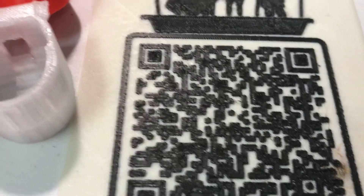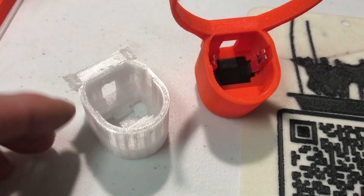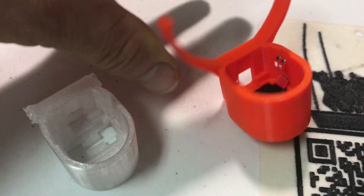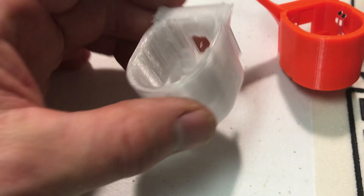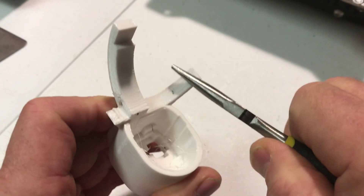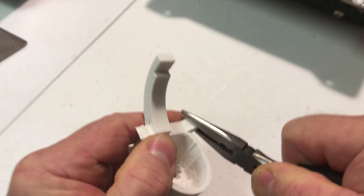I was also making these battery clips for the Ryobi — you know, these are pretty strong, you can flex them and I have no problem. But on this one particular batch, as soon as I flexed them they cracked right off. What happens is when moisture gets into the filament the material becomes very brittle and it just snaps instead of bending like it normally does.